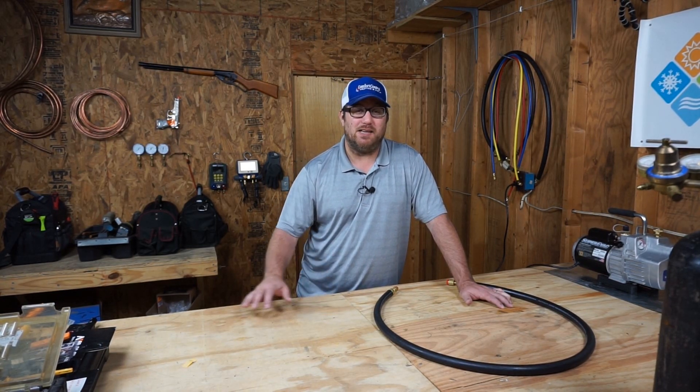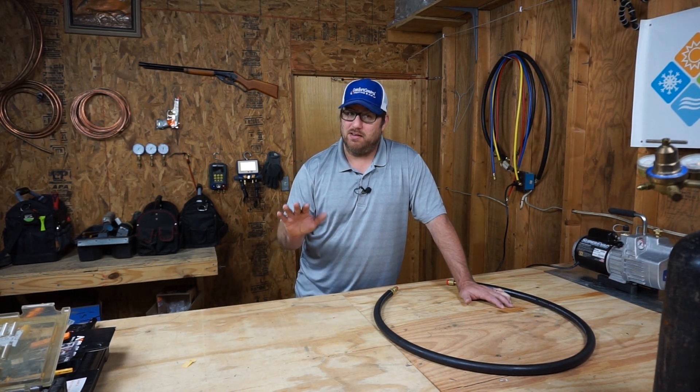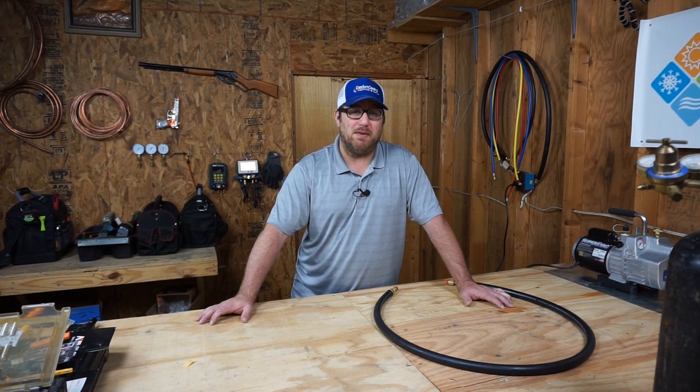We're going to give it a 15-minute vacuum test on each rig and see what ultimate vacuum we reach in that period. So 15 minutes, straight up vacuum, no load on it, no cylinders, no nothing like that, just to see what the rig can pull to in 15 minutes.